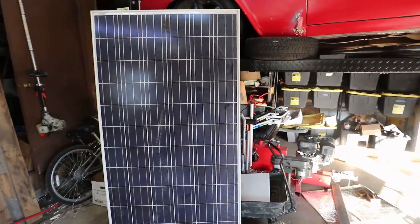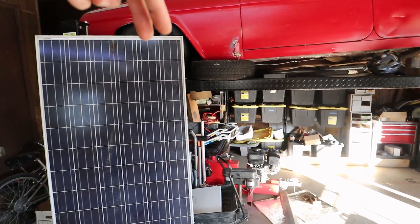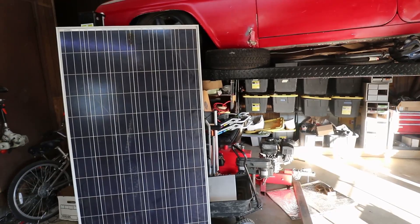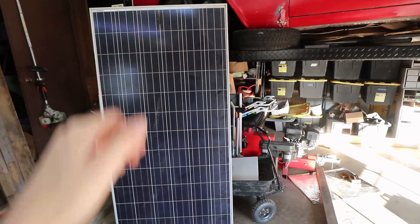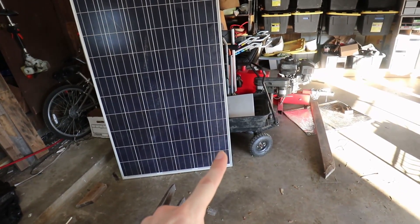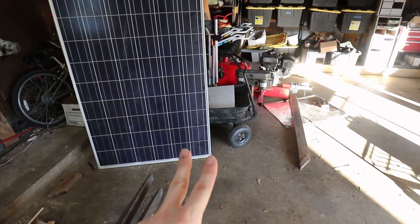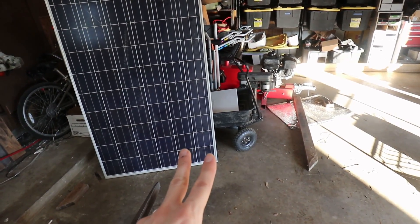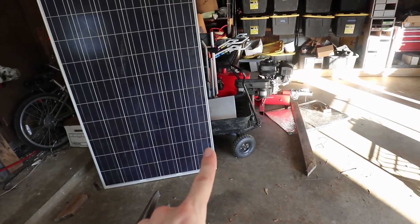At first I thought: why don't we split this into thirds? Because if this is a 36 volt panel, split into thirds that would make three 12 volt panels. But the problem is these panels are a bit used, and with just two columns of cells I would get about 14 volts open circuit — that's really not enough to charge a 12 volt battery, because you need to charge up to about 14.6 volts. So that didn't work.